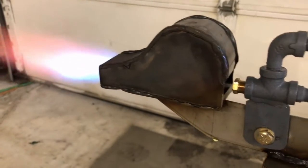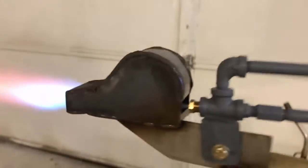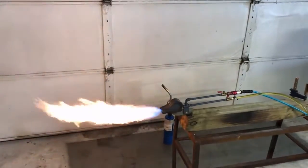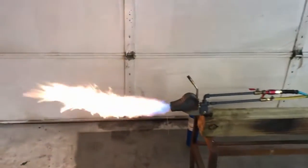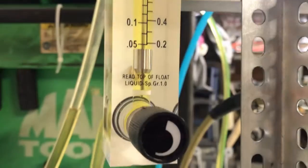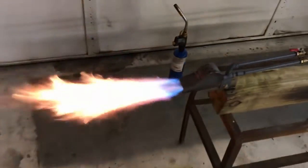I'm going to turn it down for a second here to kind of heat it up. I sprayed a little too much fuel in there in the beginning and I'm going to burn that out. Just to show you the turn-down rate, this thing can be turned down to very low. That's 120 kilowatts again. I'm going to turn it down to about 90 kilowatts here. I just wanted to show you guys how large of a flame we can get out of this little air compressor. That was about 90 kilowatts. You can see the preburner's doing really well at that rate, getting a good flame.